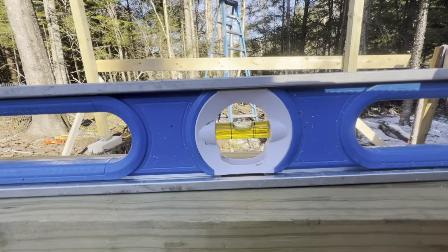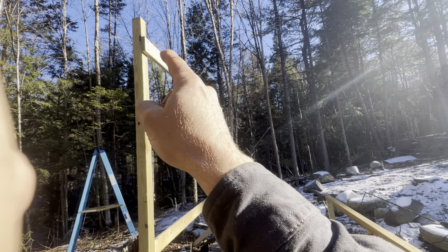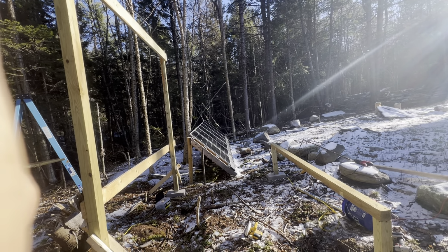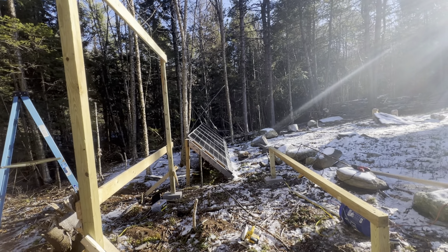So there's gonna be rafters that are gonna sit on this back wall or this lower one and go up 40 degrees to there. I've already done the math, so I know the base here is 8 feet. We have a 40-degree angle, which is gonna give us, the rafters themselves are gonna sit 11 feet from there to there, but have a foot of overhang. So I have 12 feet total, which is what I need for the panels. So we'll start working on that here in a second. It's always the fun part, cutting rafters.